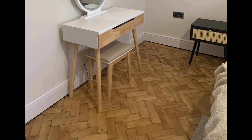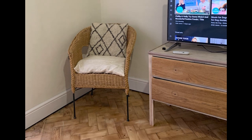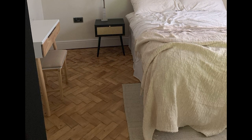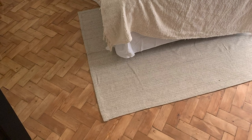A lot of people are trying to put original features back in their homes, and I think this parquet floor will get a lot of love. I hope this helps — if you're thinking about doing a reclaimed parquet flooring project and dreading scraping off the bitumen, try the Leuco adhesive first. It's a little pricey but it works brilliantly. The worst part was the sanding, so if you can hire a professional company to do that, even better. Let me know in the comments if you're thinking about doing one of these projects, and I'll see you in the next video.